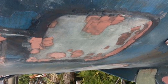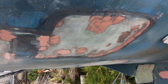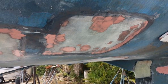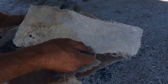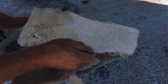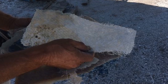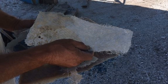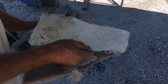Some fairly large areas of the hull were ground down and then new fiberglass and epoxy were laid in. The areas addressed were much larger than the problem areas identified in order to form a solid hull with the areas around them. In the process, one of the workers found an area of old fiberglass in the hull that was nearly bare fiberglass with little epoxy resin. It looked to be only one layer in one small section, but I'm glad we caught it before Moxie went back in the water. This could have been during initial manufacturing or possibly in follow-on repairs somewhere in Moxie's history.